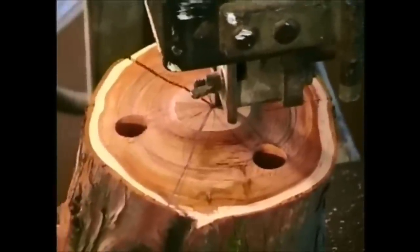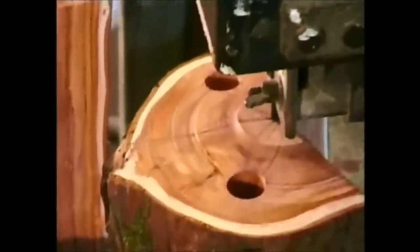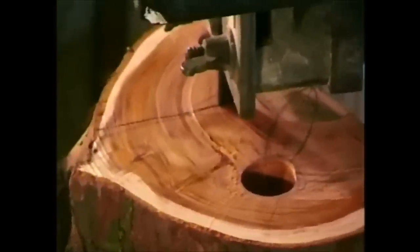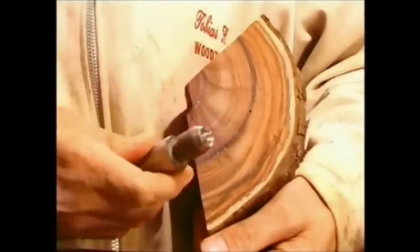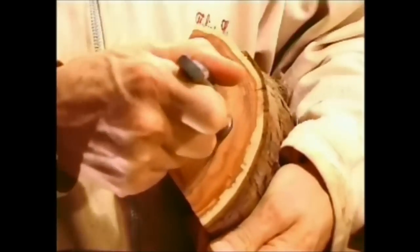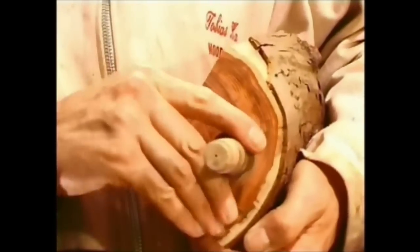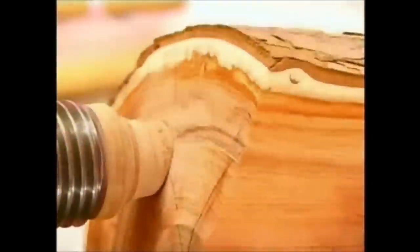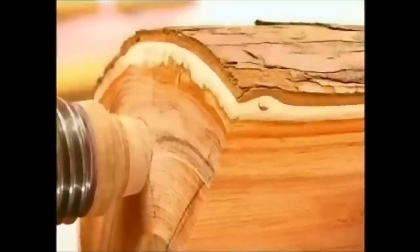Once the blade is free, repeat the operation. That frees one section entirely. Begin the last cut in the centre, ensuring the meeting point is neat. Using the divider, find the centre point of the arc you drew earlier on the base. This point could either be the drive or the tail centre. You may have a drive centre that will fit into the candle hole, or you could make a wooden friction drive to fit it. Holly is the best wood for friction drives — it gets sticky when it gets hot. Such a friction drive can be made to fit a chuck or, like this one, fit the Morse taper in the headstock.